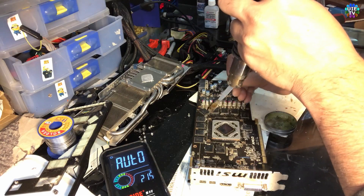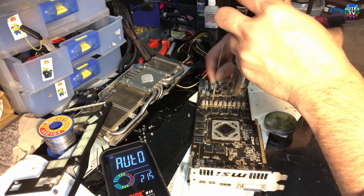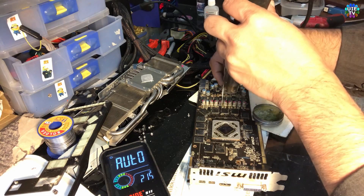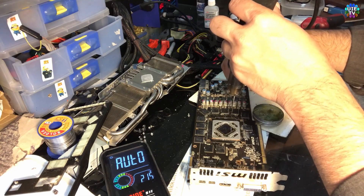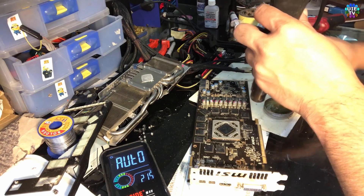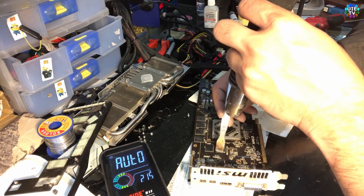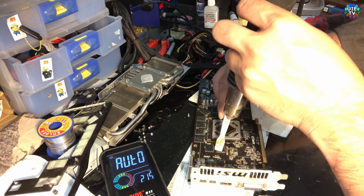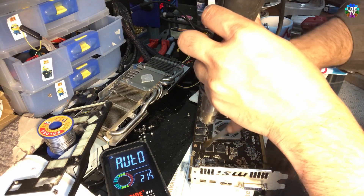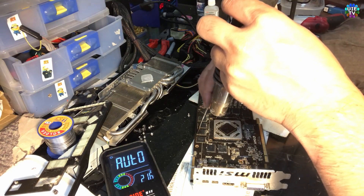So first we turn on our heat gun and melt the flux a little bit so it will be easier to apply. It's melting now — we just need to put a little bit of heat on the edges of the main chip and start applying the flux like this. You can also use it under the VRAMs, because any disconnection or corrosion there can also cause display problems. Try one side of each VRAM first.